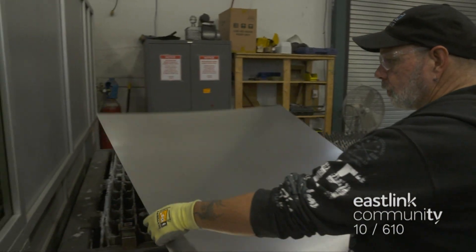Once dry, a variety of silicone plugs are used to protect any fasteners with threads from paint. The parts are now ready for powder coating, which is a paint process where paint is applied electrostatically as a free-flowing, dry powder. When the part is electrostatically charged, the paint is attracted to it, creating an even coat of paint.